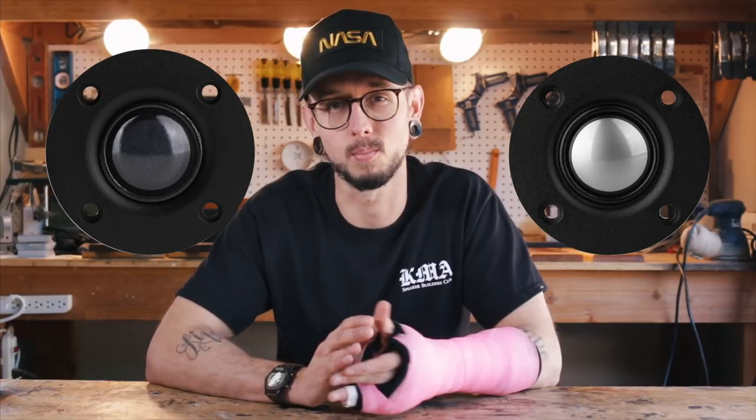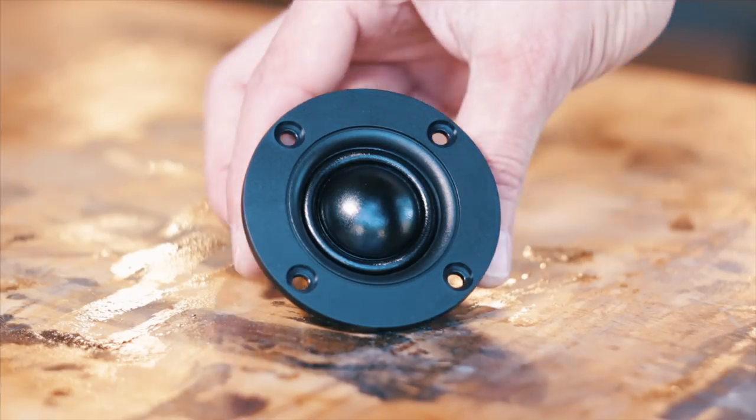That's a lot of movement. I've read in the past that the material of the dome impacts the sound of the tweeter, which it does, but maybe not in the same way I originally thought. I was under the impression that a hard dome tweeter made from titanium can be shrill or screechy, and a soft dome tweeter, like the name implies, has a softer more rounded sound. But while doing research on this tweeter I came across an article that argued against this — it even stated that the opposite was true: that soft domes can actually warp and that can cause a shrill output. I've always considered myself a fan of soft dome tweeters but I've never actually put that to the test using an A-B comparison. Now I have my doubts, so I'm going to be testing that really soon — be sure to hit that bell by the subscription button so you can be notified when that video comes out.